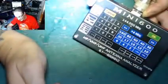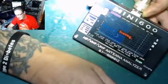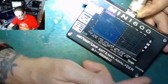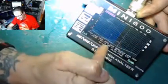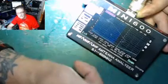4 megahertz either side of 144. I think that will do. So then you exit out of that and go to panoramic scan and then scan. I mean, this is only one of the multitude of functions on this thing. There's a little bit of a bow in it in the right place, and then you can use the arrow here and it will actually tell you SWR 1.1 at that frequency, 146.38.